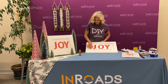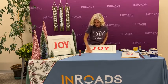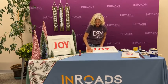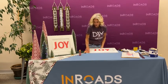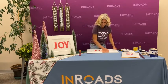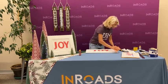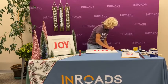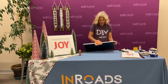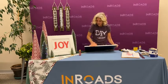of the cabinet drawer. Now, I remember I told you this one has the blue underneath it, but what's going to happen is it's really not going to show the blue, it's going to actually kind of look black, which I also like. So you can sand, you can rub hard. I like to do just around the edges, also around this outer edge. And that kind of also gives it the aged feel, aged look.